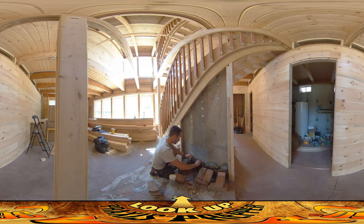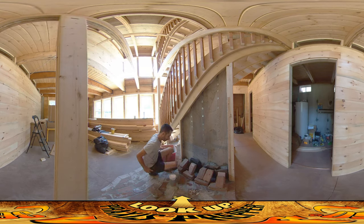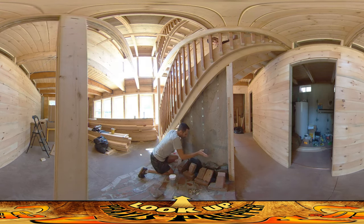I'm also noticing this stone is thinner than some of the ones next to it, so it'll actually need to come off the wall a little bit. I'm getting concrete on my fingers, which is a no-no — if you can avoid that, it's good to avoid that. Now there's a gap in the back and it's kind of wiggling, and that's what I got these scrap bricks for — I'm going to use them as little stands. It looks like it's almost an inch gap in the back there.